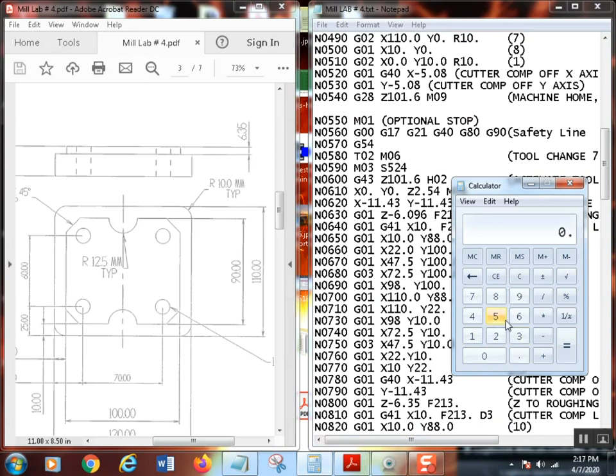We got a 7/8, that's 875 thousandths. And when I leave 20, so plus 40 thousandths, that should leave me 20 thousandths per side, plus 0.04. So that's that side right there. Now take that, of course, times 25.4 equals 23.241. That's what I would put in the tool geometry pages, the diameter for D3.